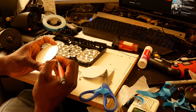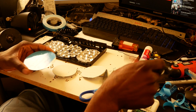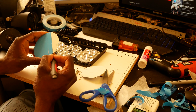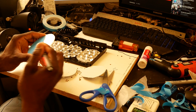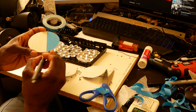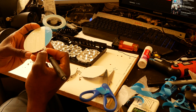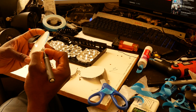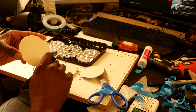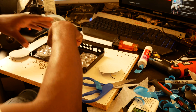It works just like thermal paste that you'd use when building a computer and mounting a CPU, but it's less messy and easier to clean up. There is also thermal adhesive paste, but that one is more permanent — it's more like an epoxy, and if you make a mistake it's very difficult to remove without potentially damaging one of your surfaces.